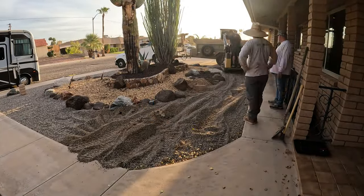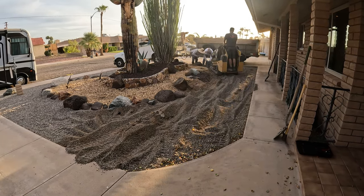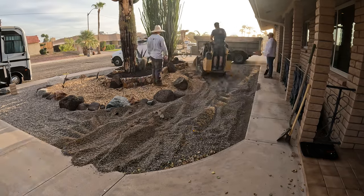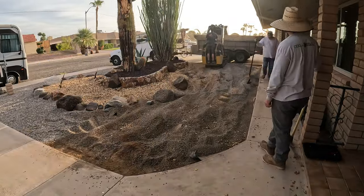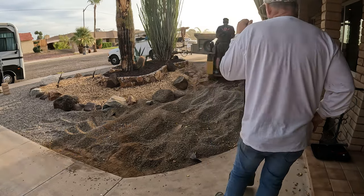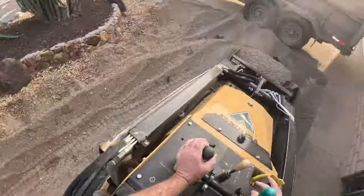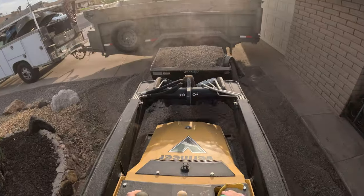We're going to go about 4.5 to 5 inches deep on this. We're going to use a wire mesh reinforcement. It's actually a 10 gauge, yeah. There is 6 gauge wire mesh, but this is a 10 gauge, and they're 6-inch squares. You'll see us rolling it out and how easy it is to put reinforcement in with wire mesh, because if you use rebar, you're probably looking at about a 2-hour install, whereas wire mesh, you can have it in here in less than 30 minutes. So that's another benefit of using wire.